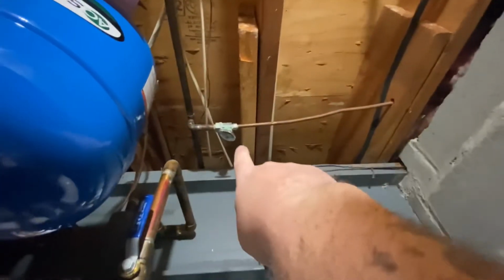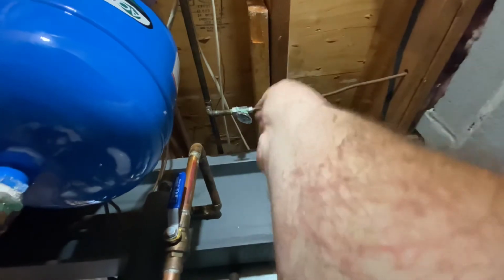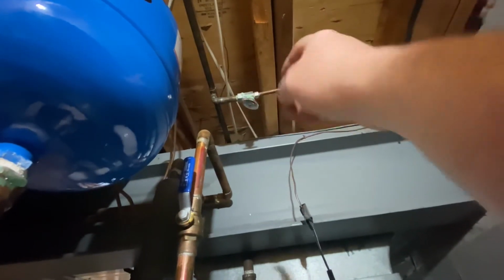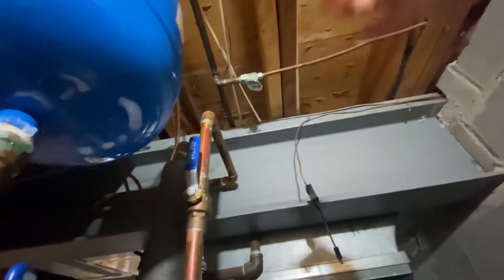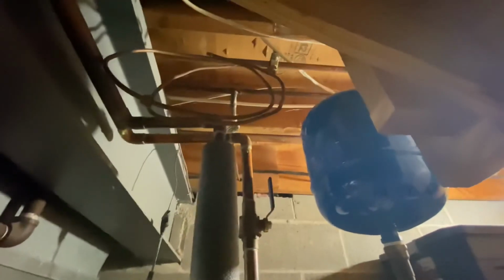And then up top, see, this is stuff I do in my houses that I live in. Like right there, that's the fridge line. It's a compression valve. I'm going to take that out, put a screw copper, and then I'll have a screw on 1/4 inch valve, and then I'm going to put an inline 5-year filter on that on top of the fridge filter to just get more life out of it. Then up here there's a saddle valve there, and there's one over here. I'm going to cut those out and just get rid of them because they suck. And so yeah, that's it. That's all.